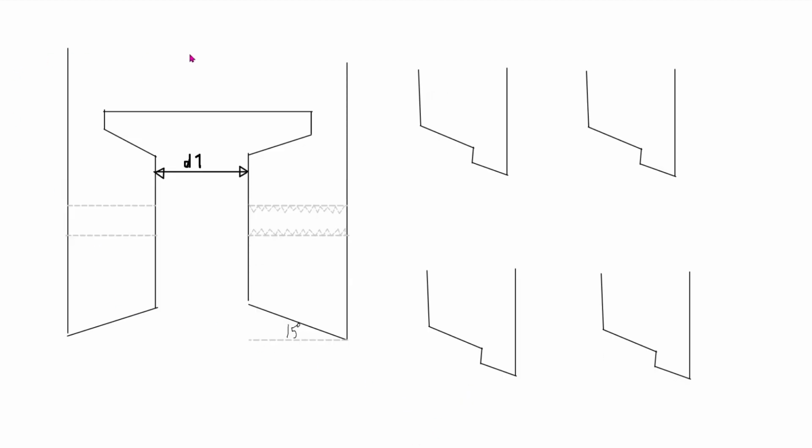So if you look at a mint Heuer vise, the dynamic jaw should look like on the left side here. So we have mint contact areas on the top, the tube, and on the bottom the slightly bigger ones are straight as an arrow. But if you look at a worn out one, the bottom will kind of look like over here on the right side. You have a worn down contact area, which is this part here, and a mint or not worn down part, which is the area that doesn't contact anything.